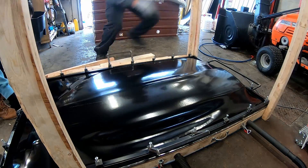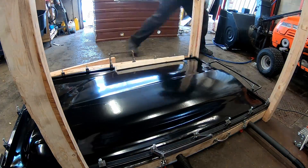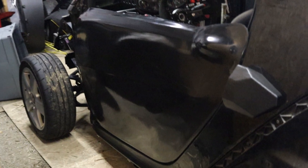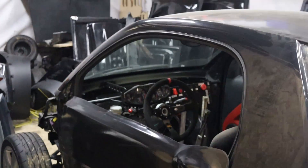I did the second pull. Since I'd just figured out the ratio trick, and to prevent creating such a big belly, I did this one colder — so the edges weren't really sharp, but luckily they didn't have to be. There it is: my first vacuum-formed panel fitted on the Smart. I double-checked the outer framing and apparently I only needed to cut about half an inch. So all those pulls trying to get sharper edges were maybe for nothing — but at least I learned things.